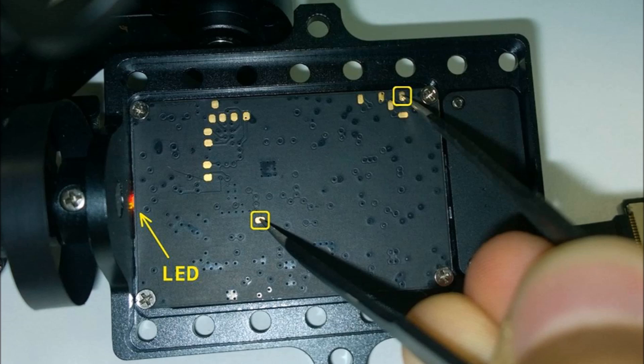If you have a glamorous assistant to help you, you could use a length of wire, holding it against both pads with two hands. While holding the short on the gimbal, power up the Phantom. As soon as you see that little LED on the side go red and yellow together — pretty much an orange colour, two separate little LEDs — immediately remove whatever you're using to short out those two jumpers. That should have then reset it. You can then plug in the assistant and re-upload the firmware.